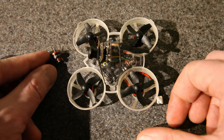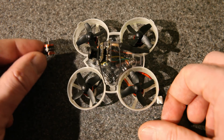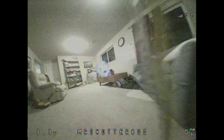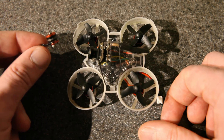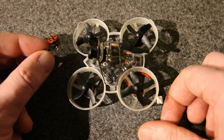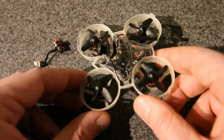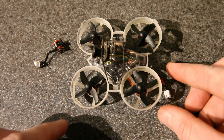That's going to give you a longer flight and less voltage sag. You're going to have a more consistent throttle response. I'm not saying the 0603s are bad — I had a lot of fun with those, and the build with the 0603 motors was really fast and snappy, especially in really small spaces. But if I used too much high throttle or continued on high throttle for more than just a moment, the voltage sag really started to bother me. With the 0802s I really enjoy the consistency of the throttle response, and I feel like I've got plenty of power — if I need to punch up over something even super late in the flight, it's pretty awesome.